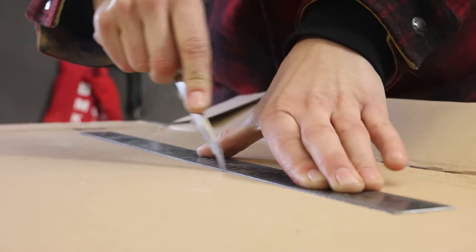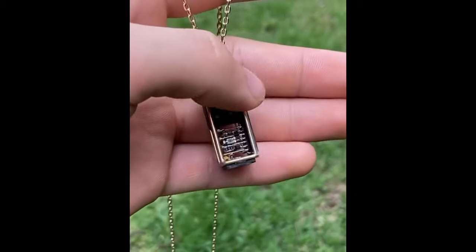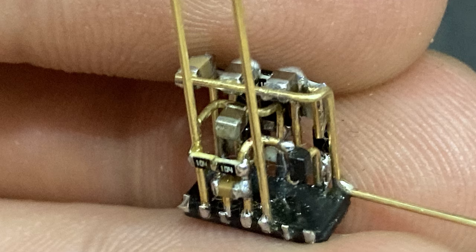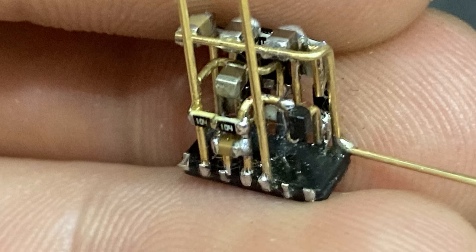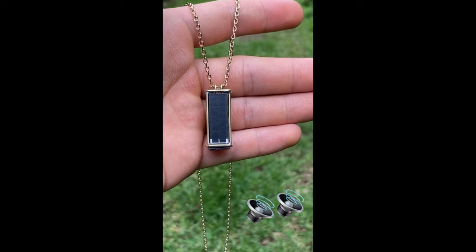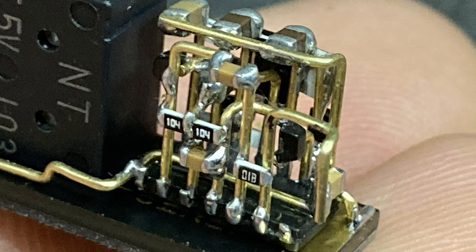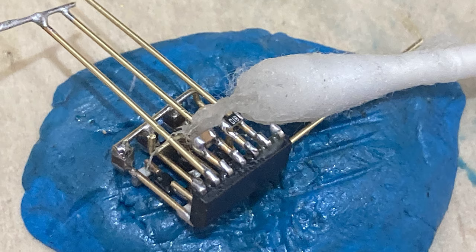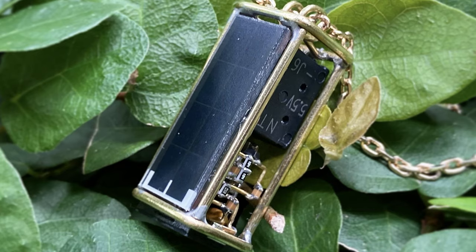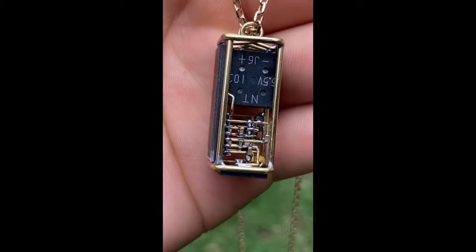It's also great to see her using a cardboard prototype to kick the whole project off. Over on Instructables I found this gorgeous freeform circuit pendant by Nano Robot Geek. The circuit is composed of a 74HC14 IC and a number of resistors and capacitors to form an array of four oscillators producing a sound that resembles a chirping bird. To keep everything as compact as possible he built the entire circuit out of 0603 surface mount components, which made this even trickier to build than your typical freeform circuit. There's a small solar cell to power the pendant so there's no need for a battery.